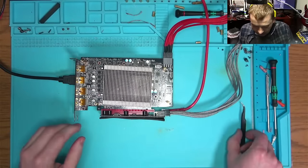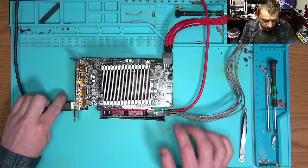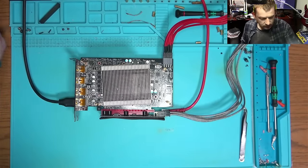Where is my HDMI cable? Let me get the HDMI cable, remove the heat sink, and let's power the card and see if it will give us a picture. I think it will — or maybe not, because we still have a lot of problems on the back with the data connections. We may not get a picture until we fix that. Yeah, we do not get a picture. Let's try DisplayPort — maybe we get a picture from DisplayPort. No, we're not getting a picture.